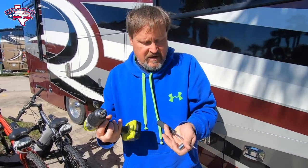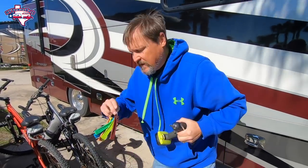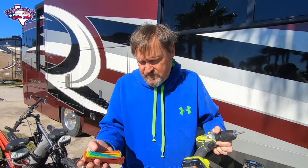These are all the tools it took right here — basically this to take the big cap off and this to take some of the internal parts off so I could get to the fan. I'm going to take you with me up there and show you the fix. Also, I'm going to show you these fin combs — on your air conditioner, if you take the tops off, sometimes those fins get all bent up, which really affects the performance of your A/C slash heater. I'm going to try to straighten those out.